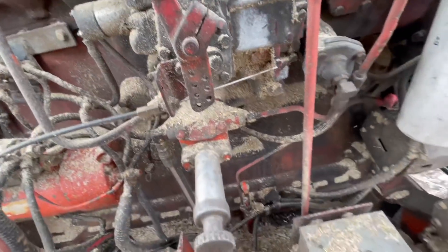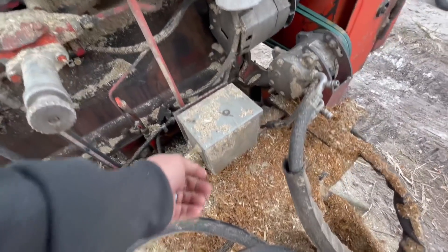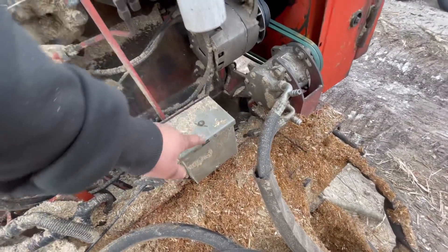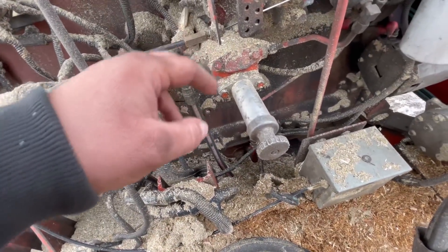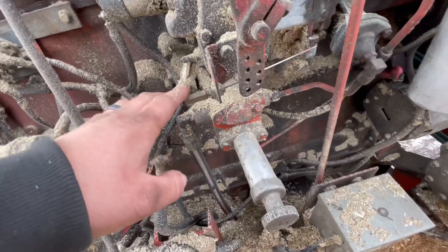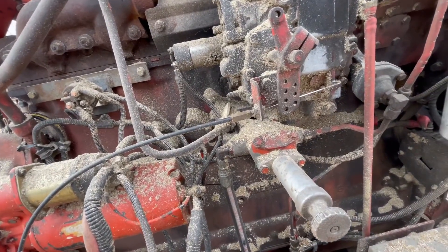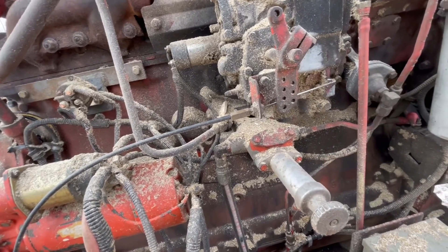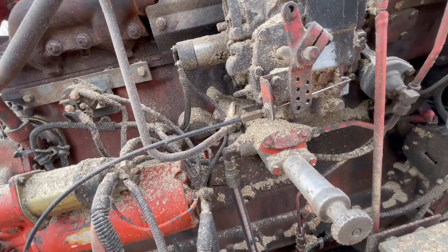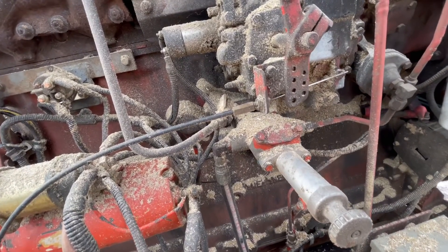You just have to get that lined up. The last one we had on here, years and years ago, this got froze up — got some water in that line somewhere. You get any water in here and that freezes up, and then you can't use it. We've had that before. Happens on the old John Deere skidders a lot, always getting water in the throttle cables, and that is the worst when they freeze up.